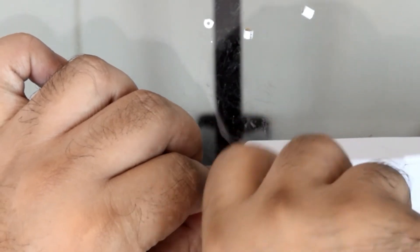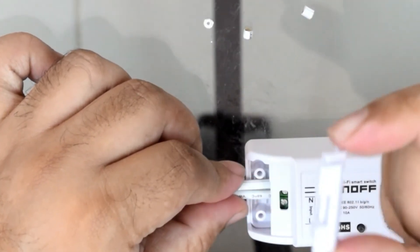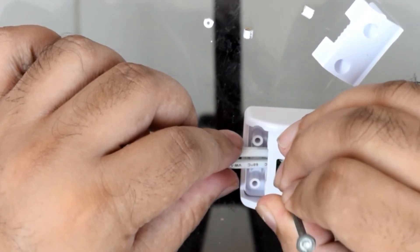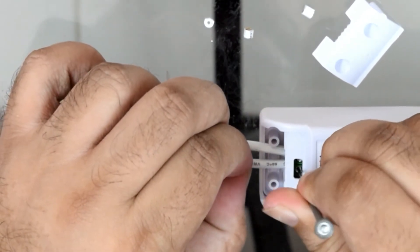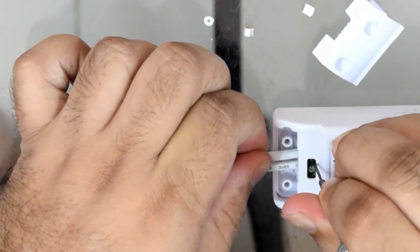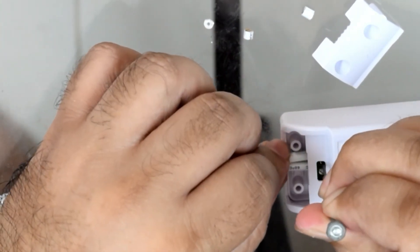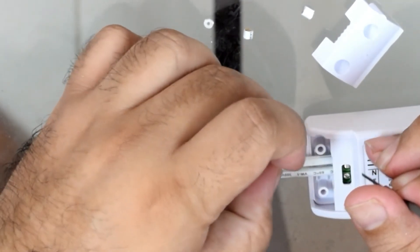The first tightening mechanism secures it but it won't be fully secure on its own — there's always a chance you could tug the wire out. That's why Sonoff provides this piece with teeth to hold onto the actual cord itself. It's a lot more durable and protects it better. It's plastic so not absolutely perfect but it does a fairly decent job. Tighten as tight as you can and hold the cord, because when you tighten the cord will want to slip back out.